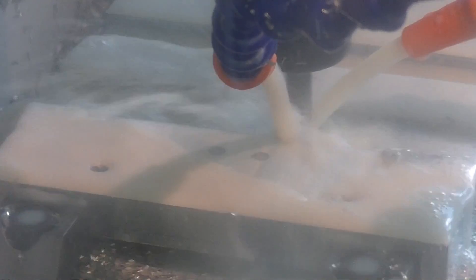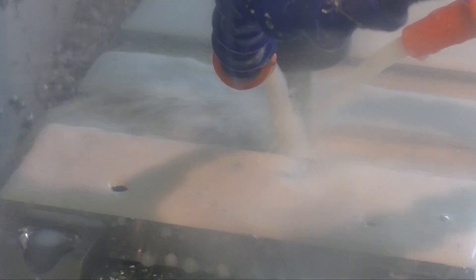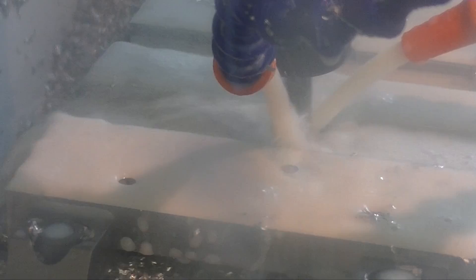I'd love feedback if you guys have some. I've already changed the direction that the stream of coolant is flowing, so it's hopefully not blowing right back onto it. But as you can see, I'm doing slotting, and so there's just a lot of chips that only have one place to go — forward or backwards. I've had the 440 for about a year and I've had this problem quite a bit. I'm even considering changing the way covers out to solid covers or something along those lines, but if you've got some feedback, please let me know.